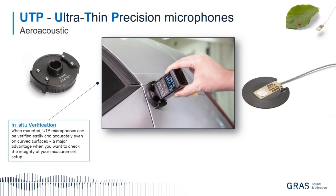We have also built into this concept, in this family, an adapter for the calibrator. Even if you have mounted a microphone on a slightly curved area, you can easily use this calibration adapter to verify that the system is okay before doing the measurement. It consists of a small cushion with distance legs. You push it gently down over the sensor, and when the cavity volume is stable, it turns green. Then you can start calibration at 250 Hz or 1 kHz in the normal way.